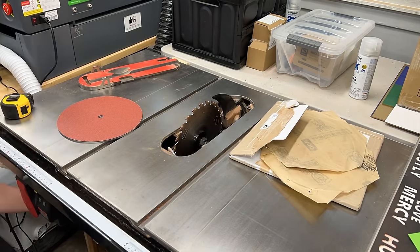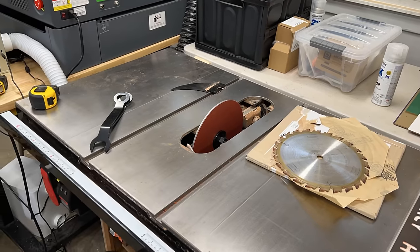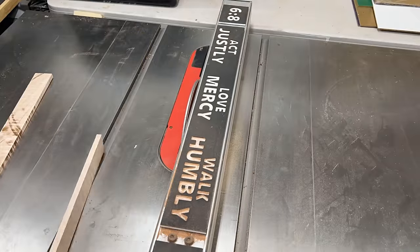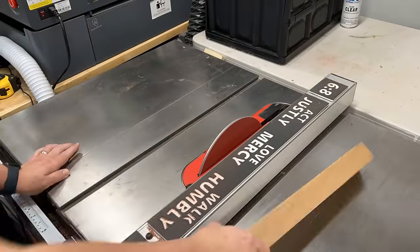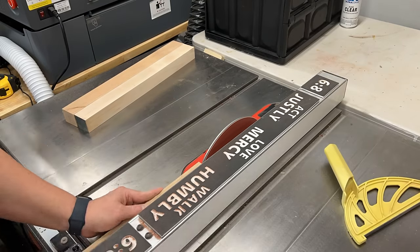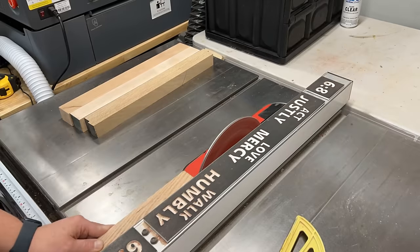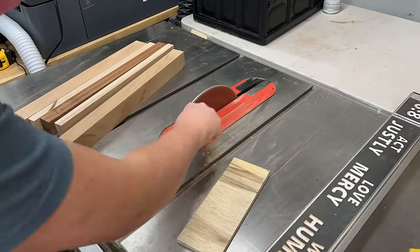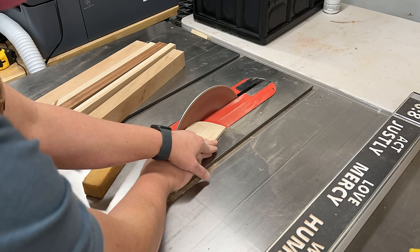One of the most affordable surfacing options is a sanding disc you add to your table saw — no teeth, just a velcro pad where you add different grits of sandpaper, making yourself a disc sander. Because it's at the table saw you can use your fence, sneak it over, line it up, and run the piece right through. Instead of cutting, that sandpaper cleans up the edges — you get perfect 90-degree perpendicular results with no snipe. It also doubles as a disc sander. Link down below.